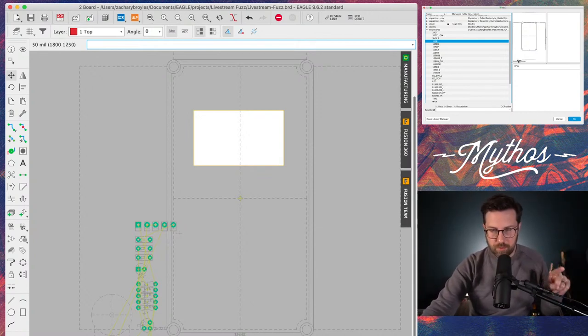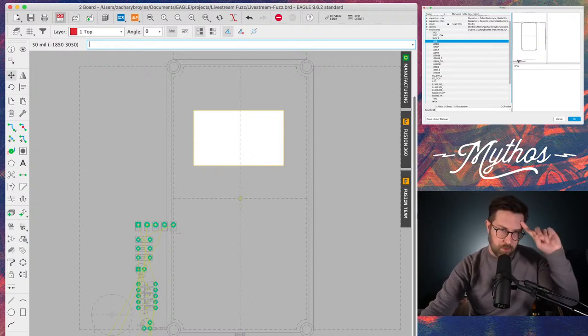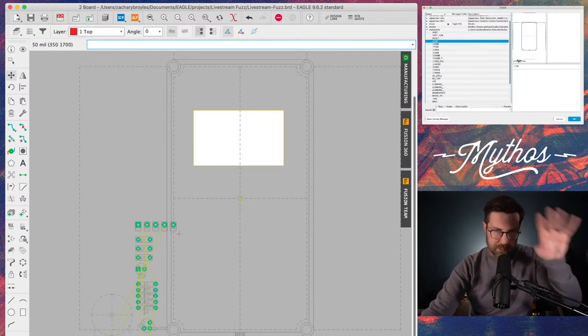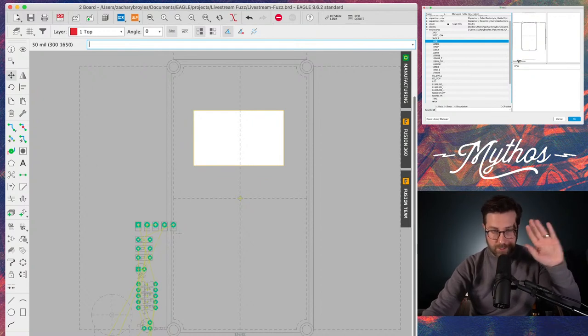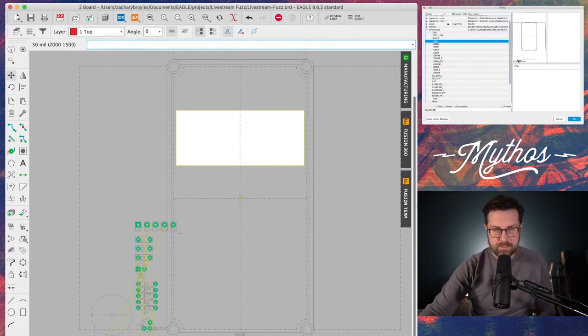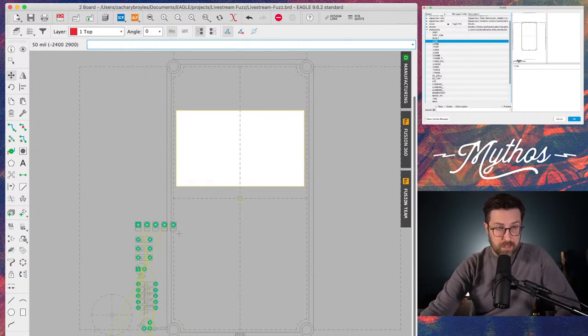And how you switch from the board view to the schematic view is up here, right by the printer. There's a switch to schematic, switch to board. Once you're on the PCB board view and you have the enclosure there, you can stretch this thing to where it's going to fit and give you all the room you could ever need. And there you go. That's rather long, and chances are this board will not have to be this big.